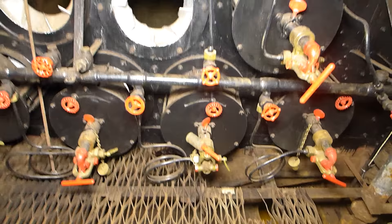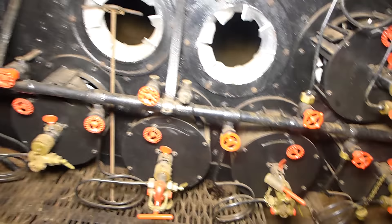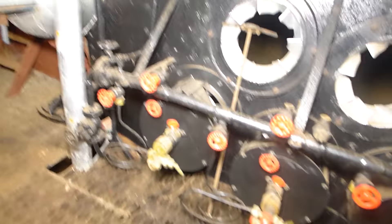One thing we know from memos was that the outer burners — on the bottom, left, and right — they tried not to run those at full blast, because there would be jets of white-hot flames coming off the ends of those burners. If those flames impinged or hit the firebrick, it would erode it. Those were the two burners that could create that problem.